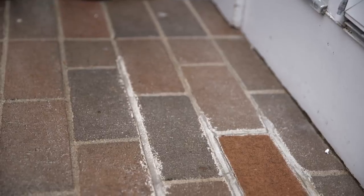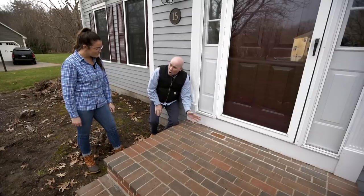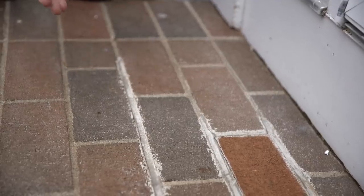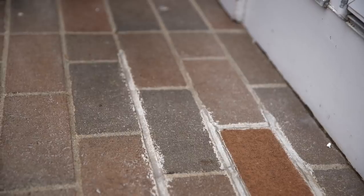What we're going to do to solve all this is actually cut out all the masonry joints about three quarters of an inch down. That's going to give us a nice new bed to apply the new mortar, which is going to be Type N. So let's get going.